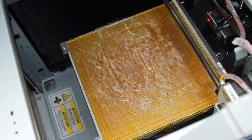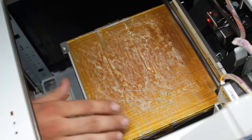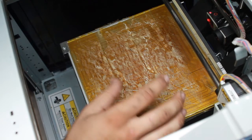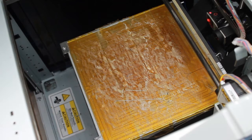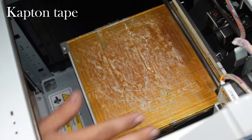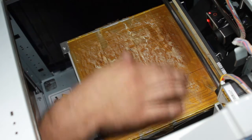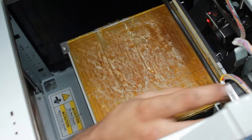I've left this printer to get as dirty as possible so I can make this video. I actually did a successful print on this because I just wanted to see how dirty it can get before stuff starts going wrong. I've got the normal standard glass bed and I've bought Kapton tape, and what I do is stick that over the bed. That stops the glass being directly connected to the print, so when the print is completed it doesn't torque. When it cools down at separate temperatures from the bed, they separate, which causes pits or chips. With the tape, the tape lifts off instead of taking glass.